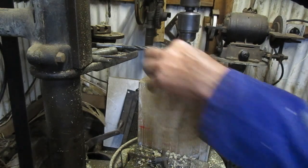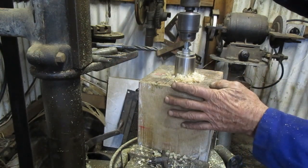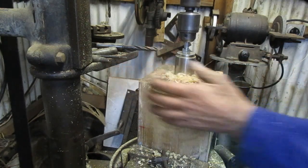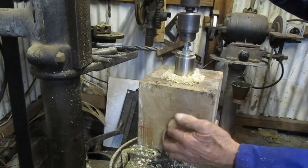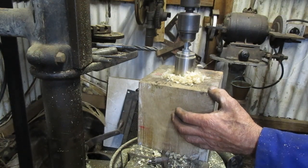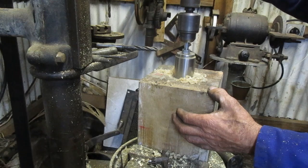What I'll do is then I'll drill here, perhaps diagonally through to the space that I've got between this seal and the other one, to be able to put a grease nipple in there and force grease into this pocket, so that at least some of it gets in. The phosphor bronze isn't going to need much, but at least if it's got some, then it should last a long time.